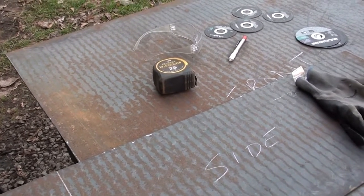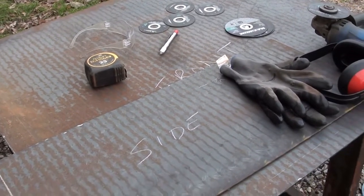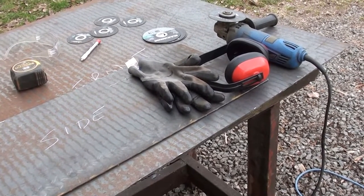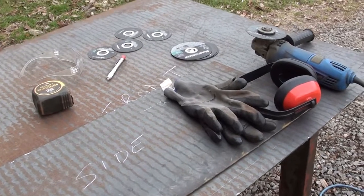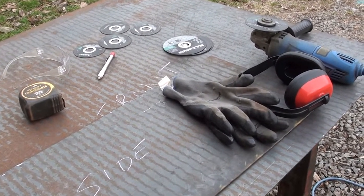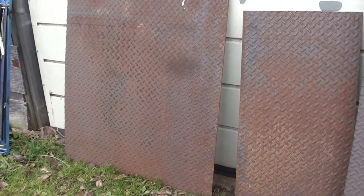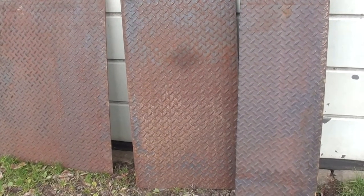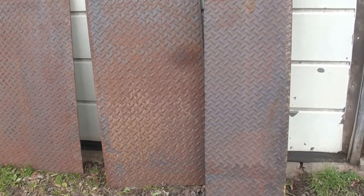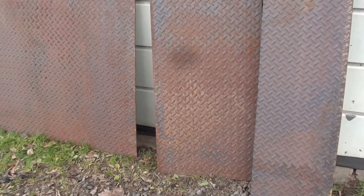Unfortunately, this is really the only way I have to cut this material. I do have a plasma cutter but it's very crappy — it would cut through this material but it would leave such a jagged rough edge with slag that the clean-up work just doesn't save time. So ultimately the most efficient and best thing I have right now is the zip cut. I'm pretty sure that this standard tread plate pattern doesn't match the actual German style — I'm not sure if you could even source that. Generally I think nowadays this pattern is pretty much the standard, so it's going to be a reasonable facsimile to the original and it's going to be functional.